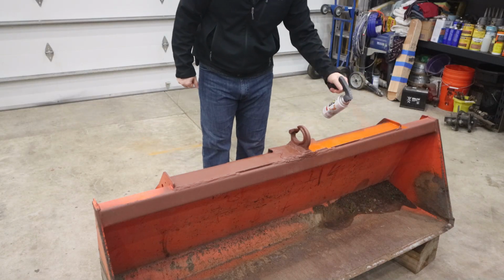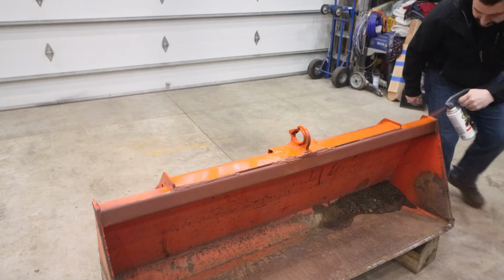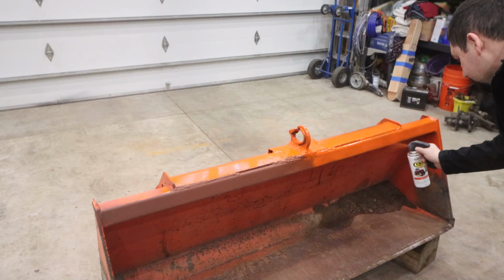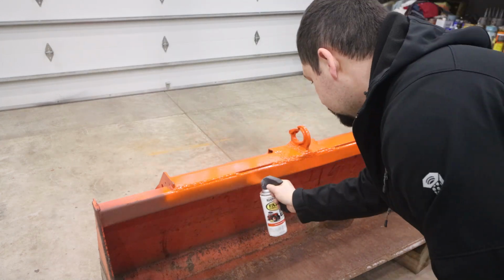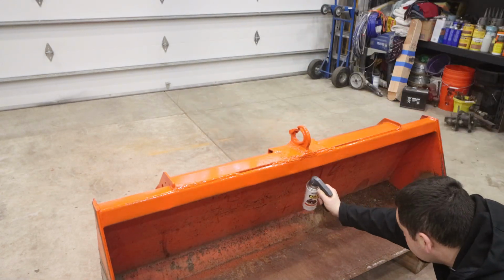Well, this is going to wrap this one up. We went ahead and removed that old towing ball that I had on the bucket that really wasn't working out how I had hoped. We ordered this new hook off Amazon. I used my stick welder, put in a backer plate, tied it into the back of the bucket, got this new hook put on there.